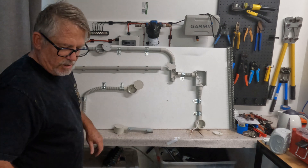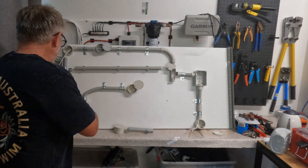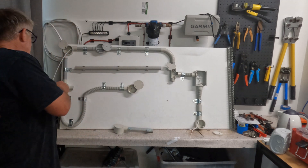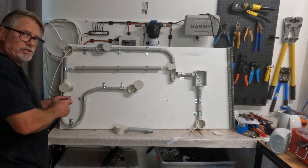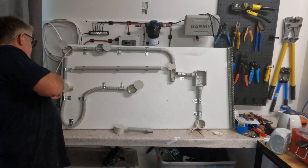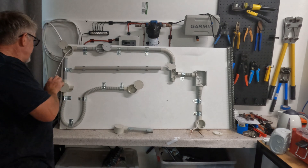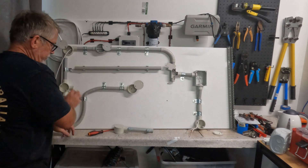You can do the same thing on far bigger systems. Corrugated conduit can be a bit tricky because it's got all the edges — the corrugations mean the cable and the snake can get caught up on those. What we do sometimes is pull the snake back out, run the cables through it, and do it little bit by little bit.